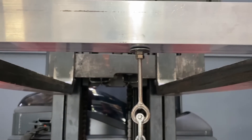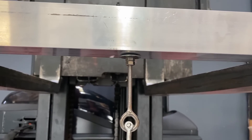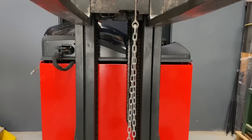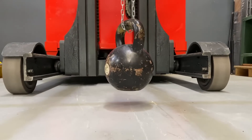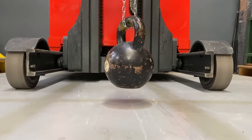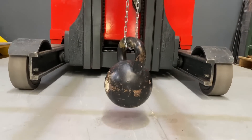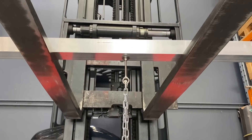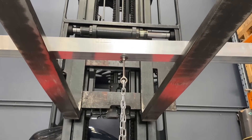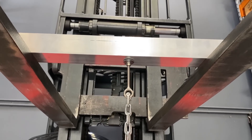As you can see, the rubber nut has got some pretty decent strength. We're not advocating you use rubber nuts for hanging heavy weights overhead by any stretch of the imagination, but this is just a bit of an extreme test to show you how strong these rubber nuts are. They're typically used for lightweight applications — automotive, and other medium to lightweight sheet metal applications. Here the rubber nut is going into some aluminium square tubing with a wall thickness of about one millimetre.